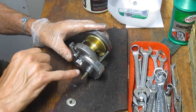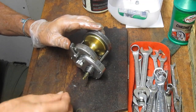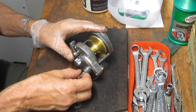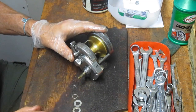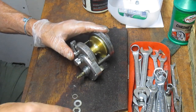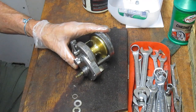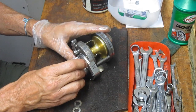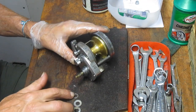We've taken off the star adjuster. We pulled out what I call the rocket pin. Next came a small washer, then two tension washers, and then an almost paper-thin washer behind that. Make sure that as you're working on these, you keep a note of the sequence that the pieces and parts came off in. I encourage folks to go get the schematic — I did not do it for this particular reel, but I encourage you to. If you get stuck, even if you didn't do it on the front end, go pull that schematic to get you back on track.